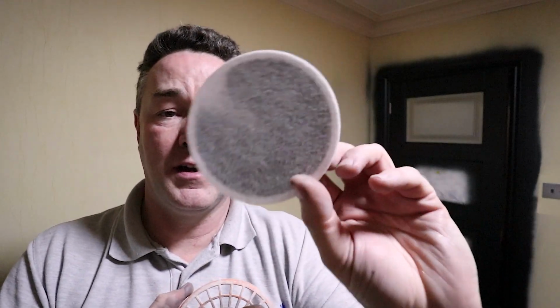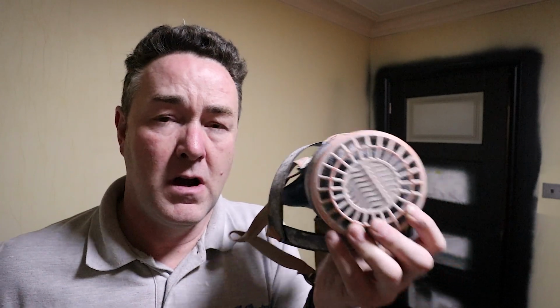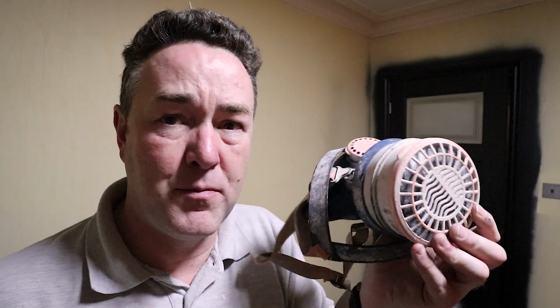That's just with this room, that's all on the outside, not on the inside. That's just with this room, two coats. Now, I didn't have loads of overspray because I got my air pressure controlled actually at the gun, but that just shows you what that's picking up. If you didn't have a mask on, a proper mask, look what you'd be breathing in.